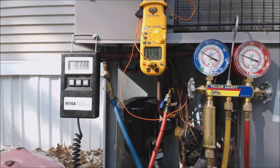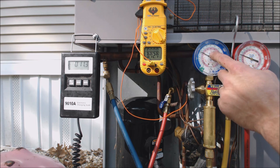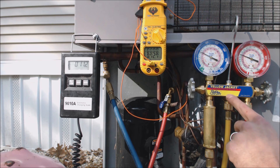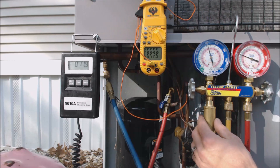We're raising the head pressure as we do this because we're putting refrigerant into the low side. The 410A bottle is upside down, coming in through the suction hose, going into the low side, and we're protecting the compressor with our liquid vaporizer.